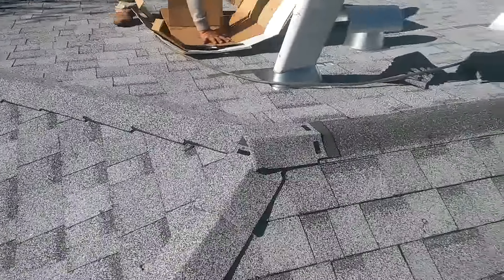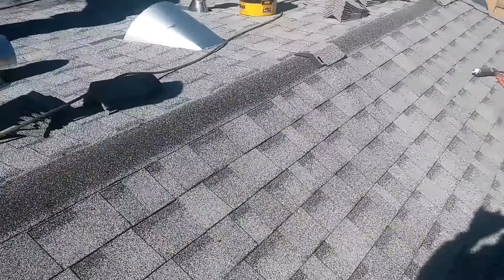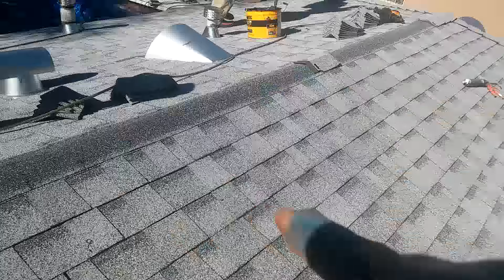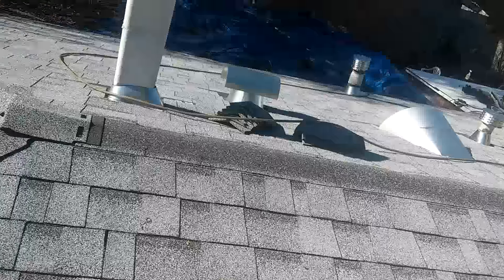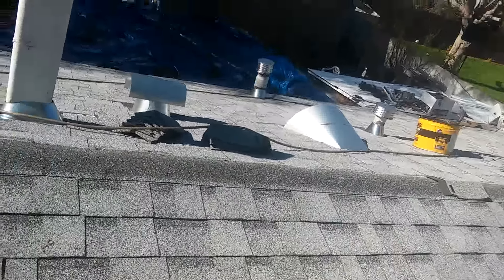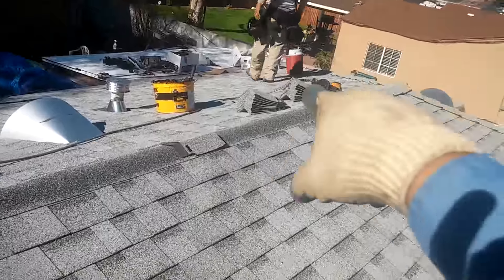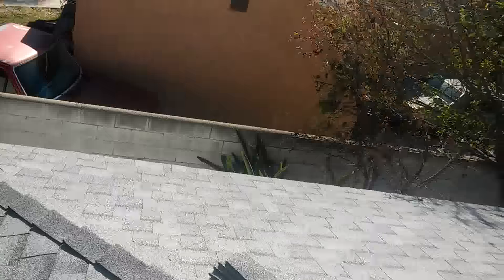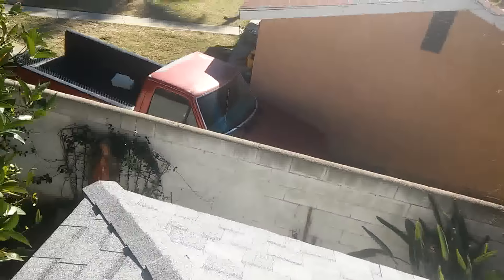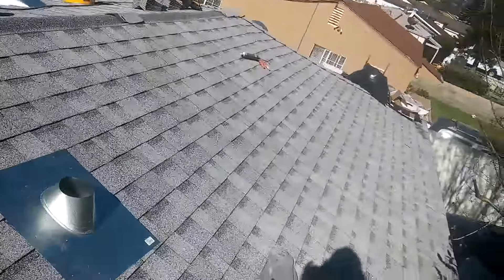After I finish my hips I put the first ridge on the ridge. Then I find the center of the top ridge and that's where I'm going to join this side and that side. On tile you usually follow one direction, but with shingles you generally meet in the middle. This side I'm going to finish in the middle, that side I'm going to finish in the middle. 99.9% of roofers out there do it the way I do it, but you can follow your own pattern.